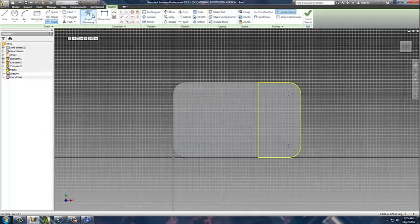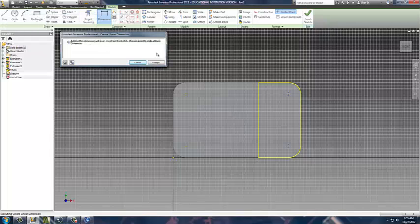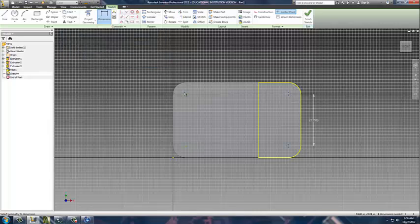Now I'm eyeballing this, and I will control it with the dimensions shortly. And that one. So once I've placed those, I'm going to put a dimension on here just to show you what it does. It's 2.25 in between the holes. That is correct, okay, but what is going on is it is a driven dimension. In other words, it's being controlled because it shares a center point with this radius. That's fine for right now. I have no problem with that.